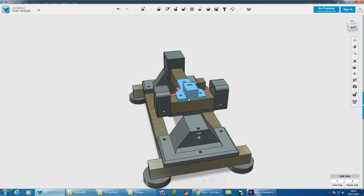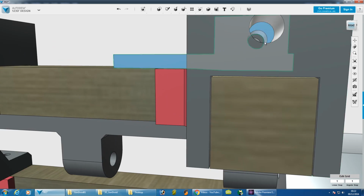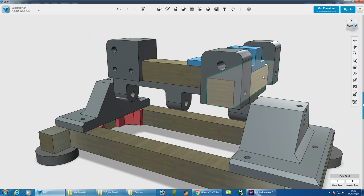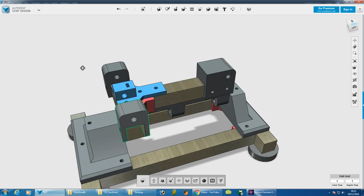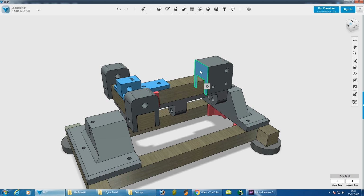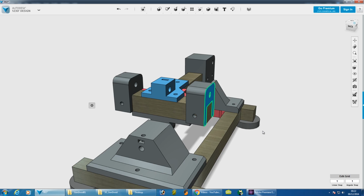That also has the captive nut in, which is going to hold a 6mm stainless steel shaft to go all the way through those holes to stop it slipping out. And of course these parts again are HT because it's high impact, and we'll print those with this surface flat on the bed and this surface flat on the bed. So let's have a look at those.